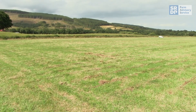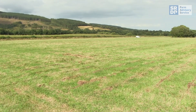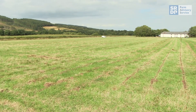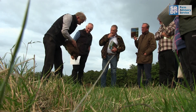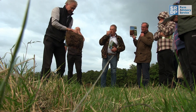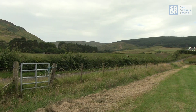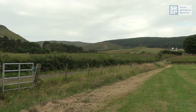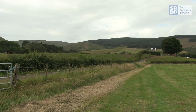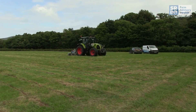So what do we do? One option is to come through with a subsoiler, a sward lifter, or an aerator - three different machines. To that I would add the plough because it in itself can actually undo a lot of damage. You'd have all seen it on your own farm: water lying, it's simply because there's been a degree of compaction, whether that comes from cattle or tractors - think of the heavy loads we've taken off silage.